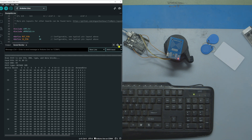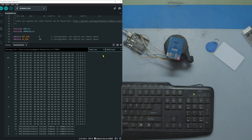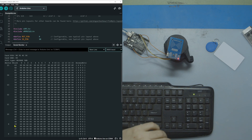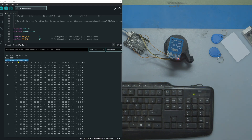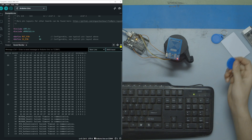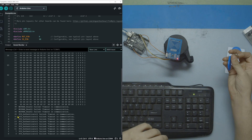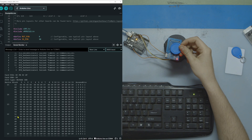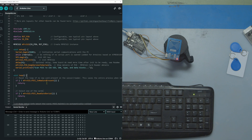Clearing the console and scanning one of the small key tags — it also shows Mifare one kilobyte, so these actually work too. We can store information on these blue tags and on the big key card. One important thing to note: you do need to hold the card on the reader until it's done reading. If you pull it off early you can see it fails with a timeout communication error. So you can't just walk up, scan your card, and leave — you have to hold it there for a bit.